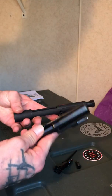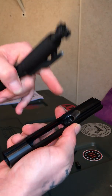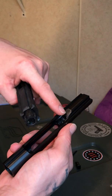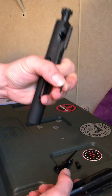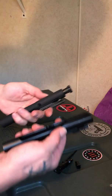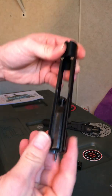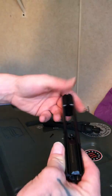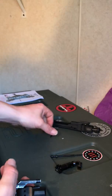A good reason why a lot of people like the M16 bolt over the AR-15 bolt is you get more closure around your firing pin. Right here is where your bolt slides down. It is possible — I have seen firing pins kind of get hung up a little bit. What happens then is the little pin here that holds your firing pin in place — I have seen these bend and I've seen them break. It does happen. Some bolt carrier groups you can shoot thousands of rounds and it runs perfect, then all of a sudden this gets hung up a little bit and then this bends real bad or breaks. That can either cause this to break, or your pin is going to bend or break.